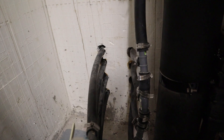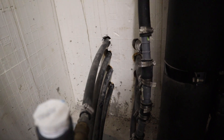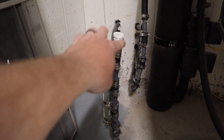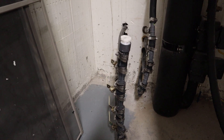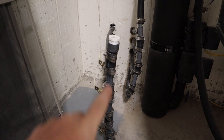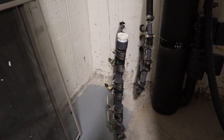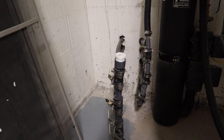As you can see, I ran my pipes vertically through the wall — one stacked on top of the other — and that has a certain advantage when you're doing a manifold-type system. The top one has a nice little cap so I can get all the air out of the system. If you run them horizontally, you'll probably need to put a 90-degree elbow in so you can still purge that air out. Either way works — each has its own advantage, and it really comes down to what space you have. It's application-specific.